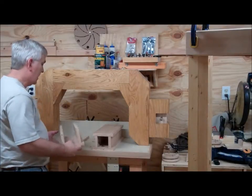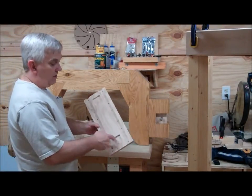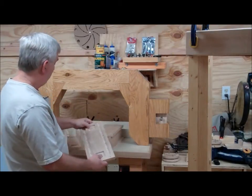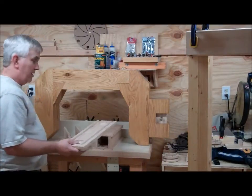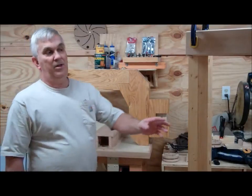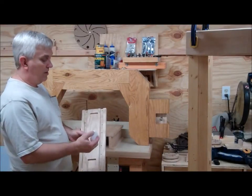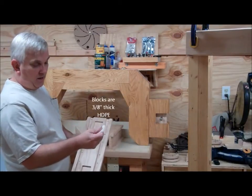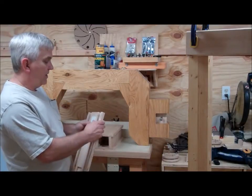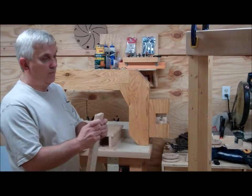What I came up with to make it slide easily — if you look, this is one I've already got glued up. While I had this on my CNC router, I used it to cut a five-sixteenths-deep pocket right here, and you can see there's two places on all four sides of these. I made the inside of this, so when it's all glued up, it's about three and an eighth inches, and this post is three by three. So that gives me an eighth inch worth of play. I cut these five-sixteenths-deep pockets and I've got these little blocks which are high-density polyethylene — the smooth kind, not the textured — and that is just slick as all get out. I cut these so they'll fit in there, and notice that when you push them in, they only stick out a sixteenth. So a sixteenth on all four sides should take up the eighth inch of play.